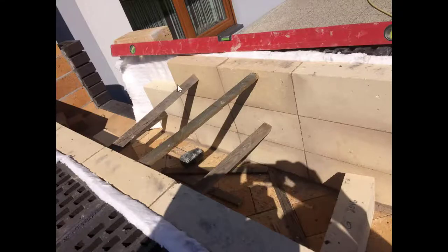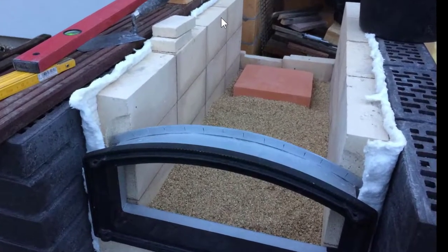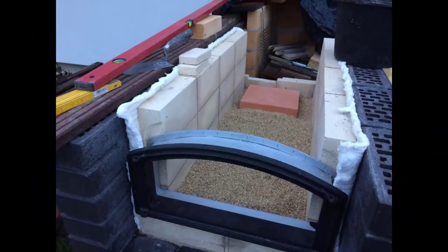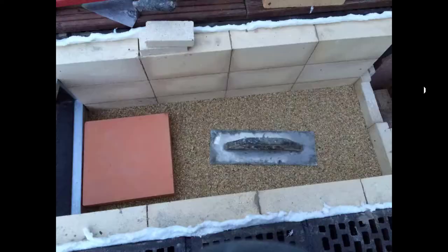I marked a line to start building the walls and made the special thermo-resistant concrete for this type of work, putting it layer by layer. In front there is the extra cutout for the doors. The left side wall is done, and the right side wall is almost done with about one millimeter spacing between bricks — typical for this type of concrete. On the next day I started to make the floor: I filled it with gravel starting from the doors to make it flat, used a special tool to compress it, then laid the floor bricks on it, cutting smaller parts to fit perfectly.